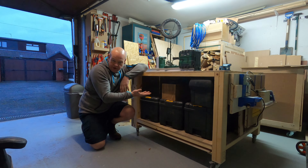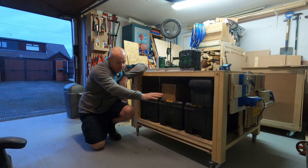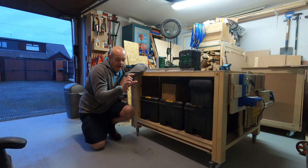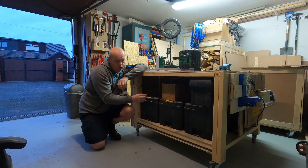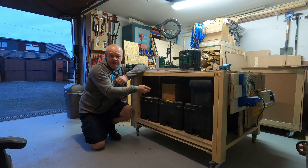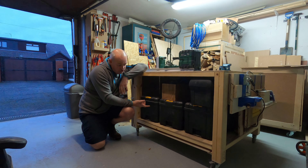I could literally put a shelf in here and put some stuff on it — that was the first idea. But then I thought, why not a drawer? Because there's lots of other things I could store in it. I could keep some tools in it, these clamps could go in it. The plan is to put a hard surface on it, a piece of wood for the drawer to rest on, but I'm going to use two slices of wood like a little groove — like a manual drawer slide made out of wood as opposed to expensive drawer slides.